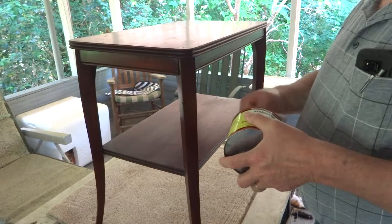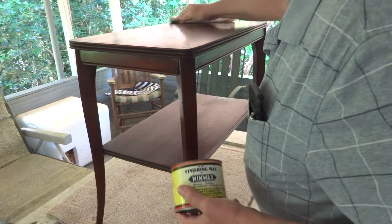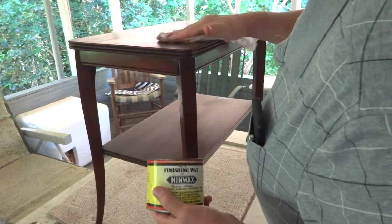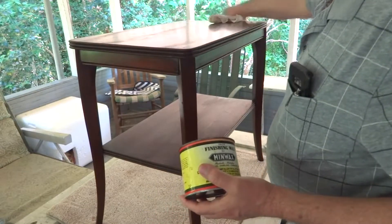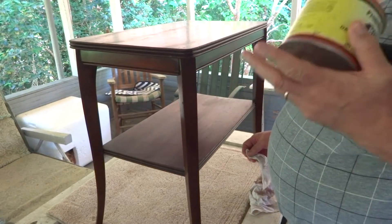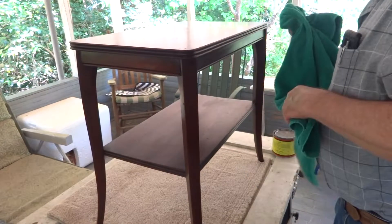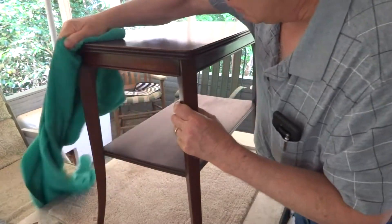You can even use car wax if you want to. For crafters, there's a wax called Daddy Van's scented with things like lavender. That antique wax has a spicy smell that makes me want to go bake something. The downfall of using car wax is that it typically has silicones in it, and if you ever decide to refinish or paint in the future, silicones are difficult to get off and will definitely interfere with finishes — they'll cause fish-eye defects in your finish.